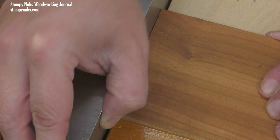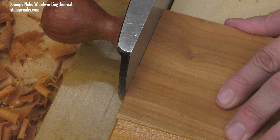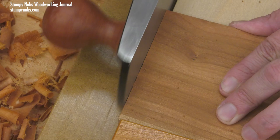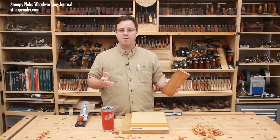Now, let me show you another little trick that may make you want to use your marking knife more. As your plane gets closer to a knife-scribed line, the surface fibers on the waste side of that line start to chip away. That leaves a fine gap between the line and the sole of the plane. It is easy to see as that gap gets narrower with each pass until it disappears. At that point, you stop planing, and you will find yourself with a perfectly trimmed board.